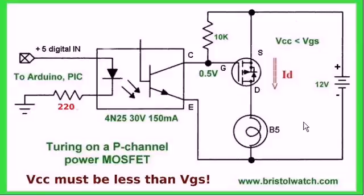Here again, we're using a P-channel power MOSFET as opposed to an N-channel — it's wired differently, of course. I'm using the detector in the optocoupler to drop the gate voltage to about half a volt when it switches on. This creates a difference of around 10 to 11 volts between gate and source, switching on the transistor so the light bulb lights up. This goes right back to your basic transistor theory.